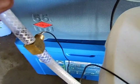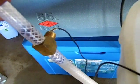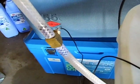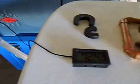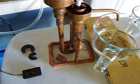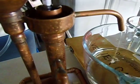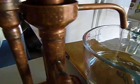Currently that water is on a temperature gauge at 72.4 degrees. And I have got a tee piece built into it with a temperature probe — that is the water outlet temperature, 72.4 degrees. And the alcohol that is coming in here is nice and cool, still running at about 95 percent.